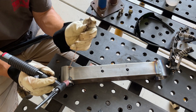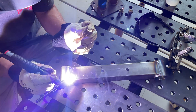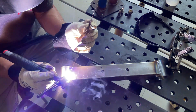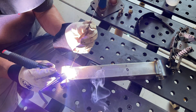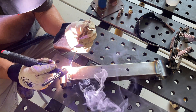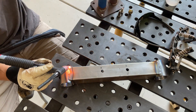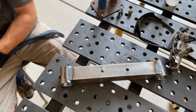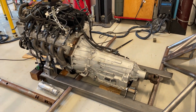The second technique is a little more difficult - this is where you really have to practice working your hand with the filler rod. I just pedal down and try to control the temperature by my travel rate across and how quickly I'm feeding in the filler rod. It's a little more tricky than pulsing with your foot. If I had my choice - and it's something I didn't learn until later - I would try to learn that rhythm of pulsing with your foot first because it really works out well.